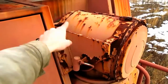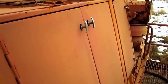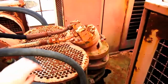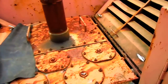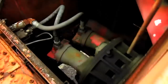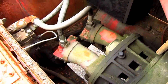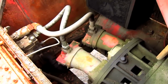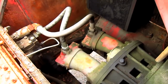You can see one right here and the other is on the opposite side. Each diesel engine on this machine drives two independent self-regulating pumps on each pump drive. The pumps operate under a pressure of 4,267 PSI. And you can see one set of the hydraulic pumps right down inside of there.